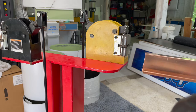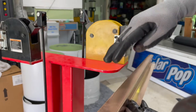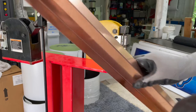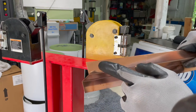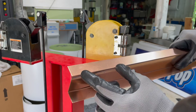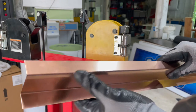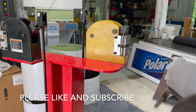This side is the stretcher. We're going to use this to make the metal curve outward — arch out this way and back around. A couple of things to note: pressure — if you give it a full press you could rip or tear the metal, so go nice and easy. The other thing is intervals — if you stretch all the way down the metal in one go it'll stretch too hard. Space yourself, go about three or four inches at a time, check how your arch is coming along. If it needs more, go in between the spots you already stretched.